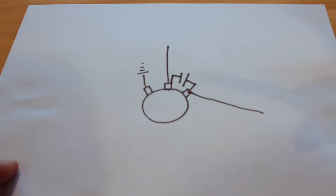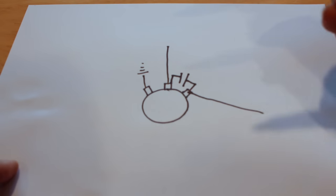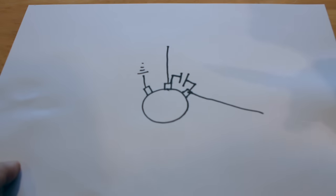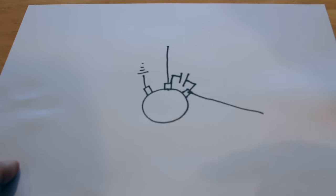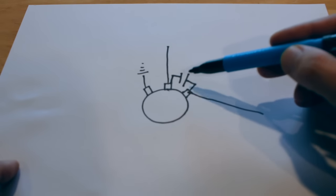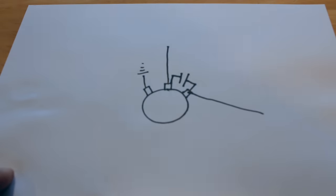What we can do is add a little shortcut so the high frequencies have their own special path to get around. One way is by adding a capacitor between these two lugs. When the resistance builds as you roll the volume down, instead of high frequencies forcing their way through, they've got their own little road to bypass that and join back up on the other side. Treble bleeds don't add any treble to your signal — all they do is create a new path for that treble to get around the pot. They're only useful if you're rolling back that volume.